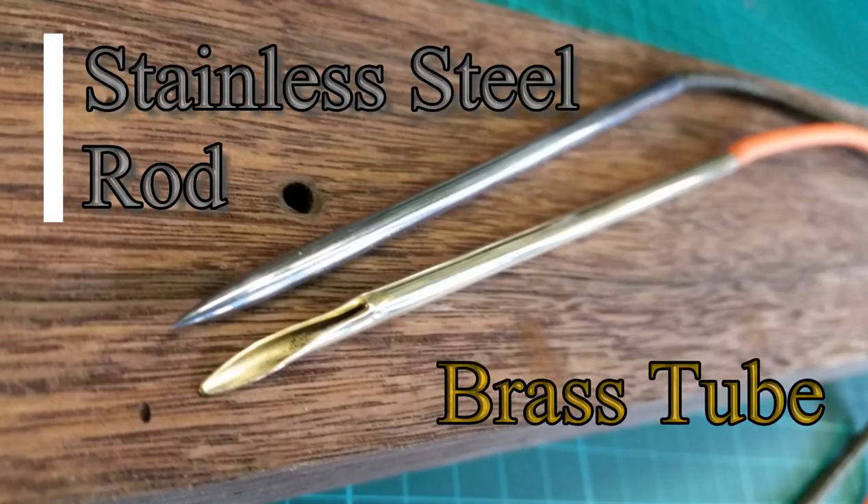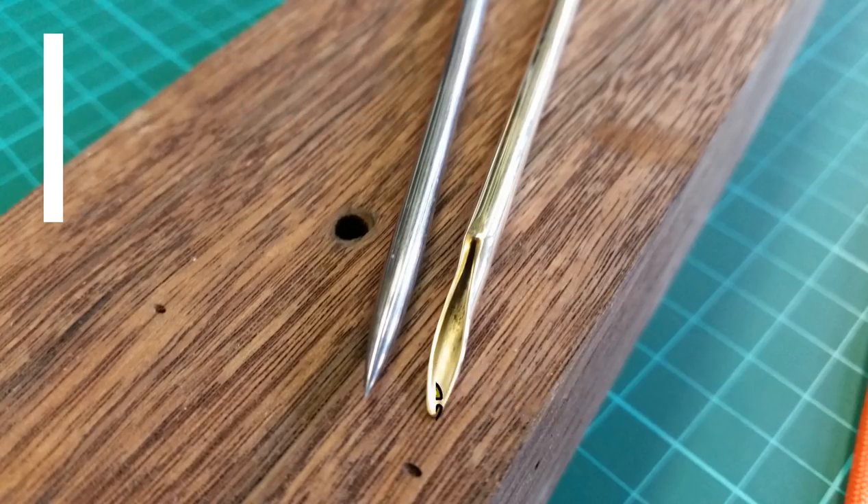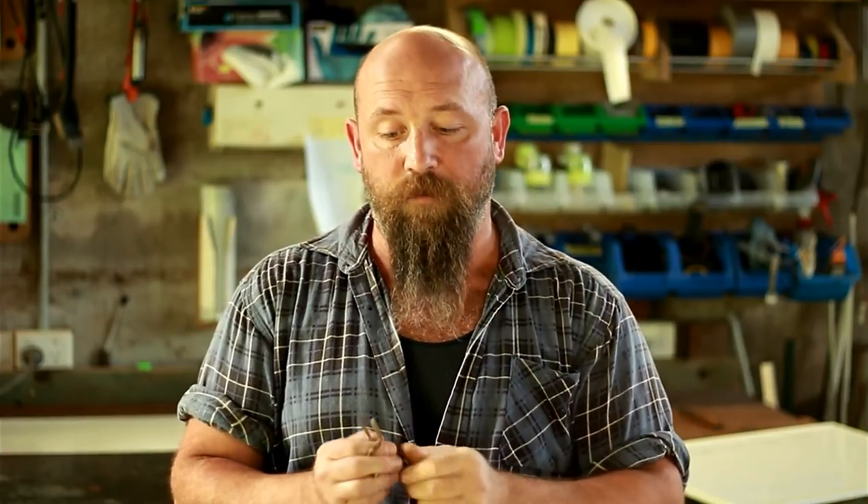I started out making these fids out of brass tubing — it's fairly simple to make, actually not difficult. I like these so much that I moved up to making them out of stainless steel. There are a lot of advantages to making a proper paracord needle fid. The DIY brass tube ones will get you out of a bind, but they're not maintenance-free — they go blunt quickly and collapse around the tube. The brass tube needle fids are reasonably easy to make, but the stainless ones you need a lathe.